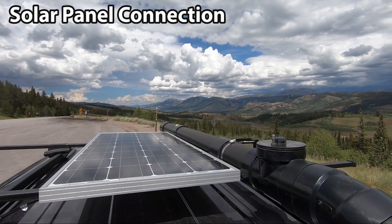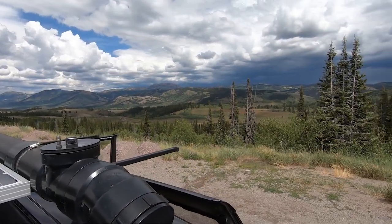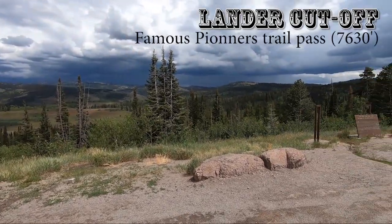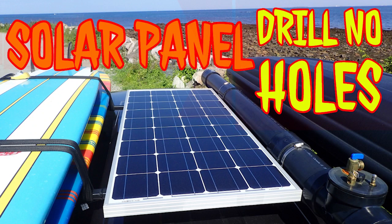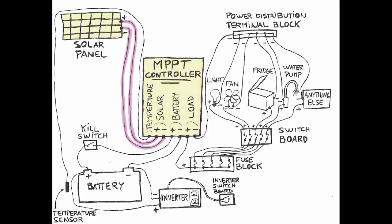Solar panel connection. After that step, the solar panel can be connected. Again, the required wires were included with the solar kit. To understand how to install the solar panel without drilling any holes, I invite you to watch my video on this. After the solar panel was installed, I simply connected the wires to the solar panel and to the proper terminal of the MPPT controller.